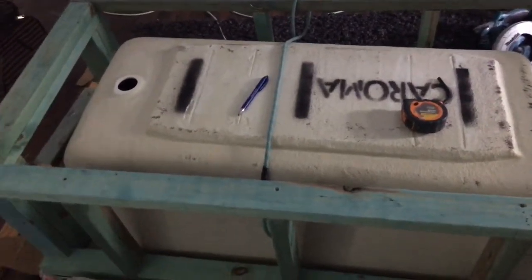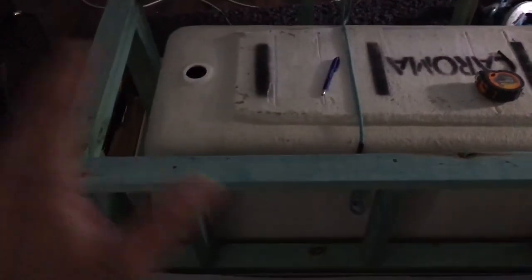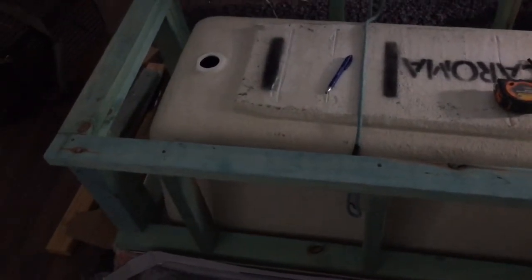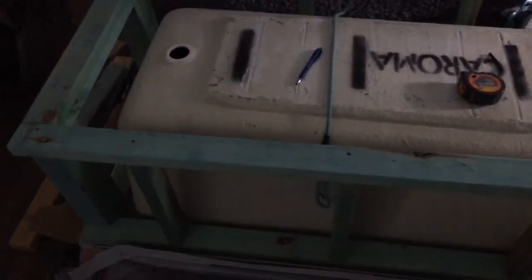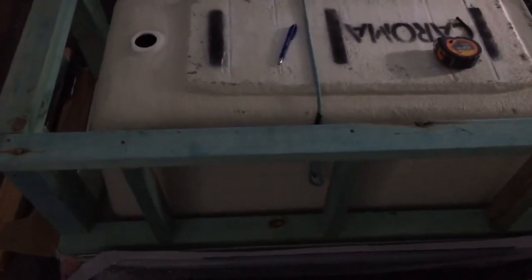Hopefully the bath will be level. There's quite a bit of working out with how you're going to tile the bath because you don't want slivers of tiles. I want a full tile at the base, and I don't want a sliver around the edge of the bath. My skirting tile is going to be a full tile, and where it goes up to the shower will probably be a half tile because I'm using a shower base. Around the edges of the bath and where the taps are, I don't want a grout line or a five-mil tile sliver, so there are one or two walls I've got to spend time working out before I actually do it.